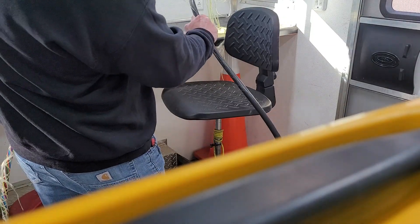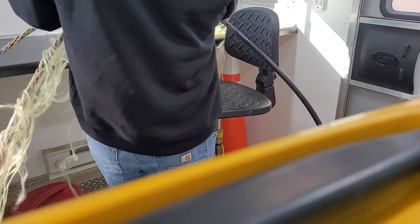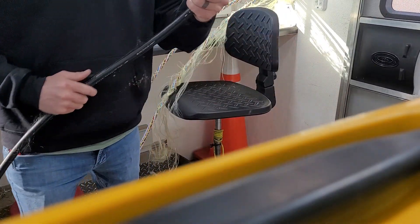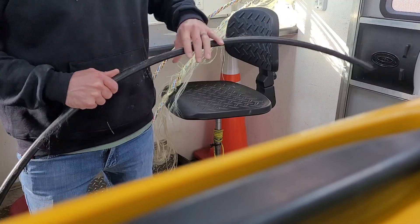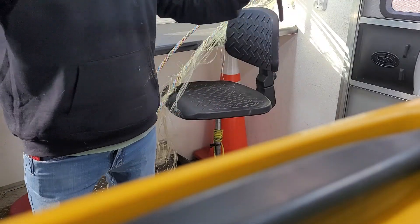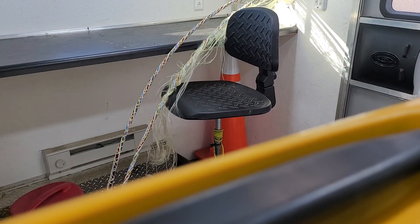For example, if I'm pulling real tight here — you see that? It's pulling tight. If I pull hard enough, it could break and bend or kink the buffer tube, and you don't want that. You just kind of twist the cable and it comes right off, because I made a ring cut on the back there as well by where the rip cord was. I pulled the rip cord past that ring cut, and that means whenever I get to that point, this will just break off pretty easily — again, if the depth is set right on the blade. That is how you access a fiber optic cable using a ring cut tool.